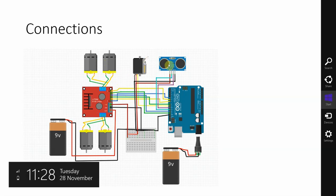There is a servo motor on which the ultrasonic sensor will be installed. I am not powering the servo from Arduino because I do not want to load it. The L298 motor driver also provides a 5V output via its built-in 5V regulator. I am taking this 5V output to power both the servo motor and the ultrasonic sensor from the same power supply. You can see the servo is connected to VCC and ground of the L298 motor driver, and the ultrasonic sensor VCC and ground are connected to the same supply.